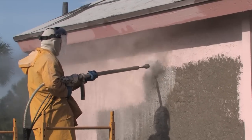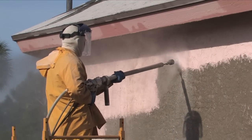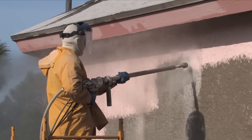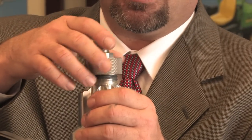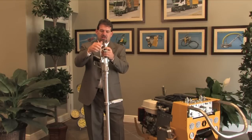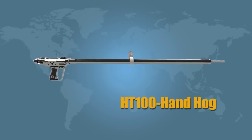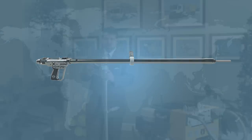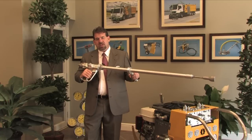It's a proven fact that powered rotational guns are about 30% more productive than self-rotated nozzles, leading to increased productivity. By having a hydraulically driven gun, you're going to see a vastly increased life expectancy in the parts and consumables inside this gun. The swivel seal is replaced by simply removing the cap screw, removing the swivel seal, putting it back together, and you're good to go for another 18 hours or so. This tool is very simply built by a contractor for a contractor. Water Blasting Technologies is proud to introduce the world's first lightweight, hydraulically driven hand tool for the contractor who demands reliability and performance. Thank you very much.